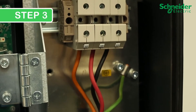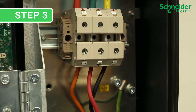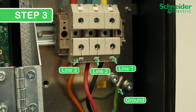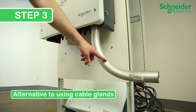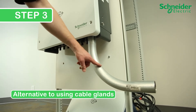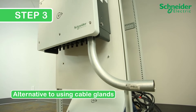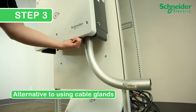Installation methodology of the AC conductors in the CL60A is similar to the CL60E with a few notable differences in configuration: three hot phases, no neutral, and the ground going directly to the mounting plate for the AC terminal block. As an alternative to using cable glands, conduit can be used with the CL60. Selection depends on your jurisdiction's regulations, and independent of conduit type, a weather-tight seal must be used with conduit to ensure the IP rating of the unit is maintained.